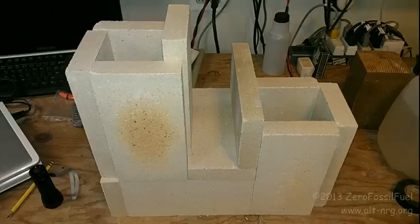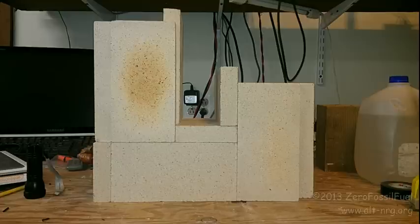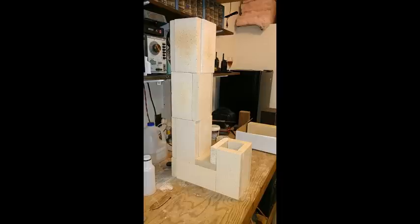In these first couple of pictures that you're about to see, this is how I took some fire brick and stacked them up to start piecing them together and figuring out exactly how I wanted my build to go. The original design I had contemplated used a 4-inch round galvanized steel flue pipe in the center of the main burn chamber. I was warned against doing that, so I accepted some advice from my YouTube viewers and decided to make the entire internal flue stack all fire brick.